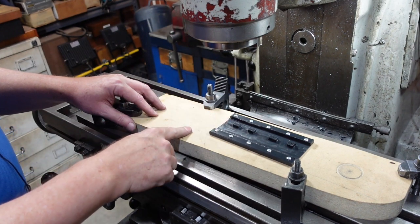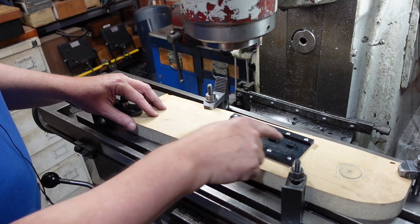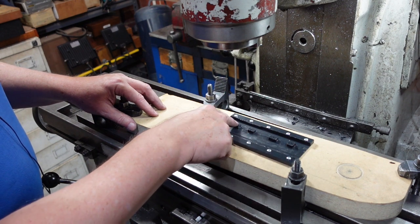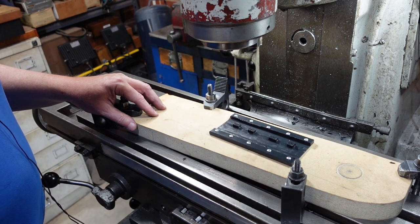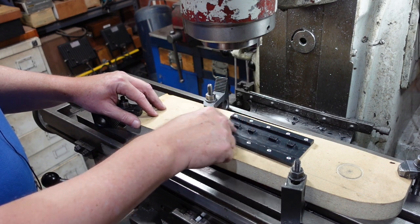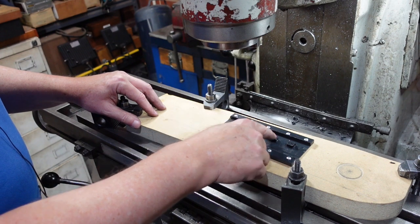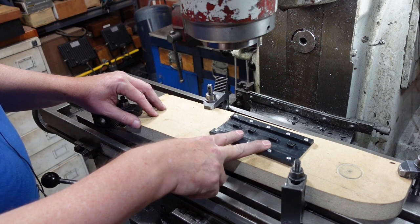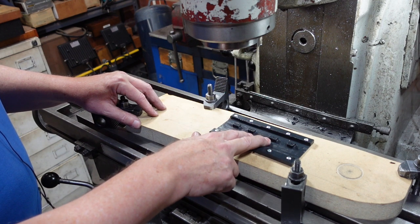The base thickness is going to be two millimetres, and then there's the bosses up top, and I've gone and cut out these islands for those. In the middle of where the screws are going to go, I've gone and put a small one and a half millimetre hole — that's just going to give me a reference point so that if I need to find that centre, I've got a physical mark I can look for. The trouble with black of course is that a black pen doesn't really show up all that well on black, so that's what I'm doing there.